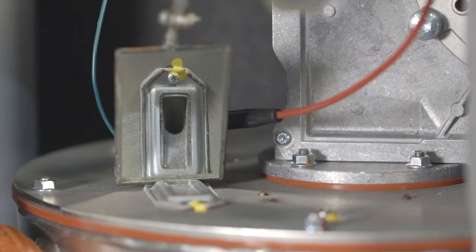You will need to inspect the burner flame through the observation port on the heat exchanger. The flame pattern should be fully blue and cover the entire burner surface during high fire, as shown here. If your flame does not appear like this, consult your user's manual for troubleshooting procedures.